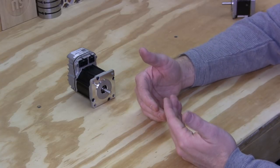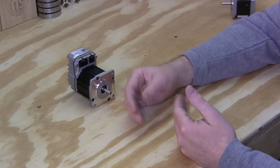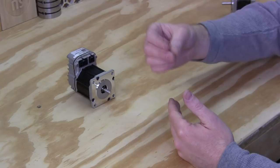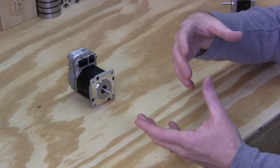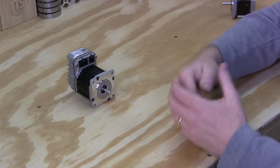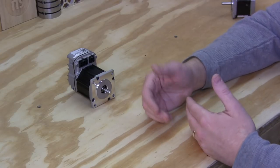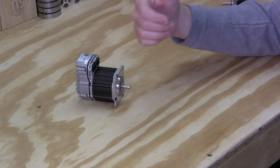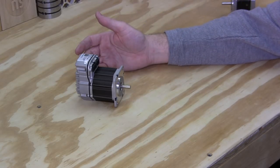The actuators that I'm using on my machine, the bumpers, they're somewhat worn since they're not new actuators. And so just for repeatability, because I knew those bumpers are somewhat squishy, I wanted the repeatability. So I basically took that responsibility away from the motor and put it on a sensor. The motor is perfectly capable of handling it. I just don't have new actuators, so I just had to find a workaround. So that's what I did. But the fact that these have the ability, that if you put hard stops or hard bumpers on your machine, you don't even need the home switches.